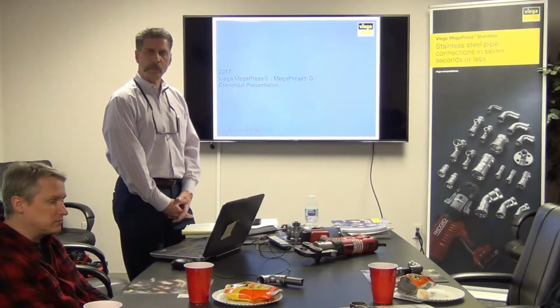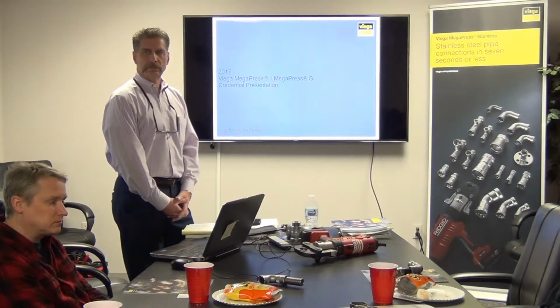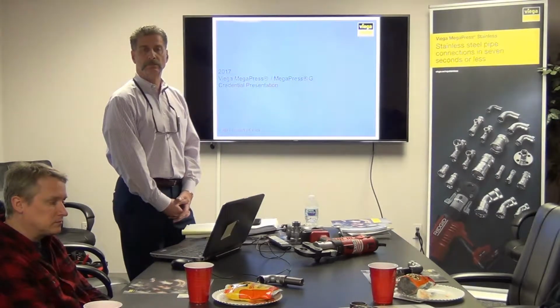And those submittals are going to say that's a 200-pound rating because of code. But we rated the system to 400, wrote a letter to the owner, engineer, and contractor, identifying that every fitting on that project is now rated to 400 PSI. So that's another question that I think you're going to get.